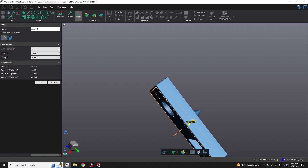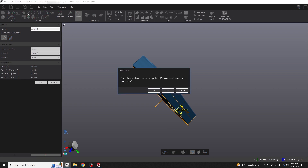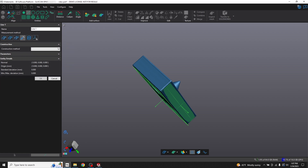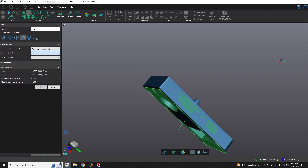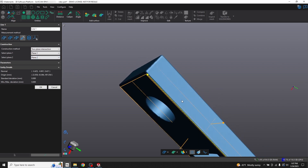So now I need to create my next plane over here, but in order to do that I'm first going to create a line. I don't need to save this angle so I'll click no. For this line I'll select constructed for the measurement method, and the construction method will be a two plane intersection. That's going to create a line at the intersection of these two planes — I select plane one and plane two. You can see the preview of that there, that yellow line, and that looks good. So I'll click OK.